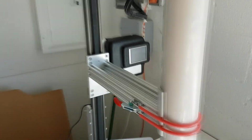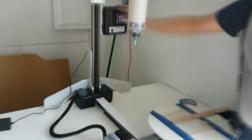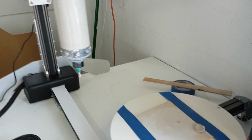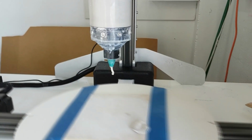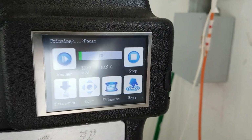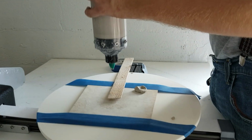When a print starts, you can pause it in the middle of a print. So to print our test pot, we'll start the program and then pause the program once it starts its actual print of moving around on the bat. You can set the extruder height by using a shim or just eyeballing it carefully. It should be 1 or 2 millimeters above the bat for its print.